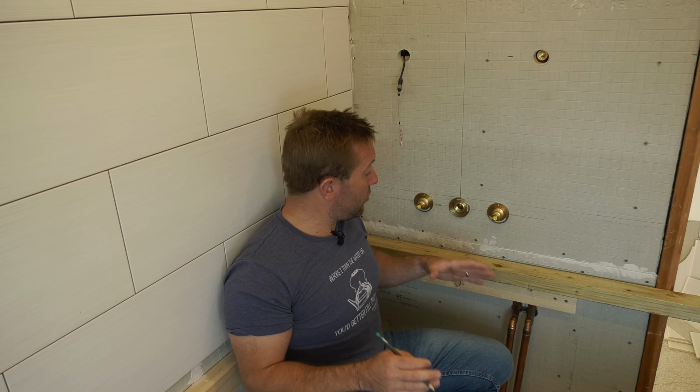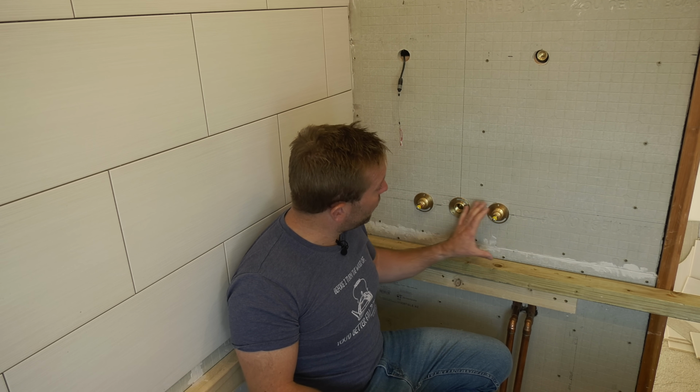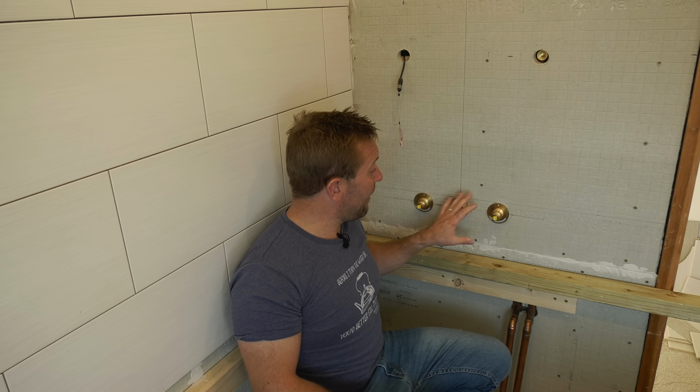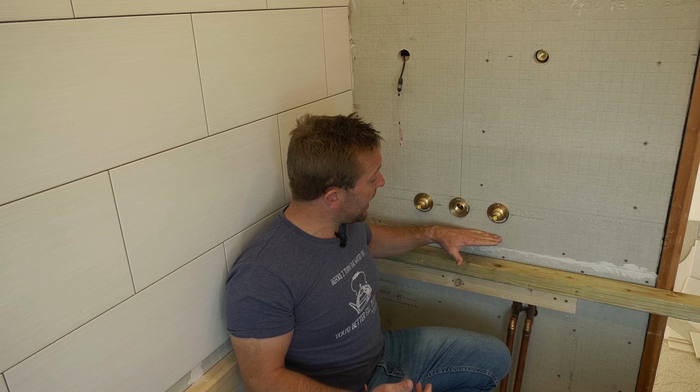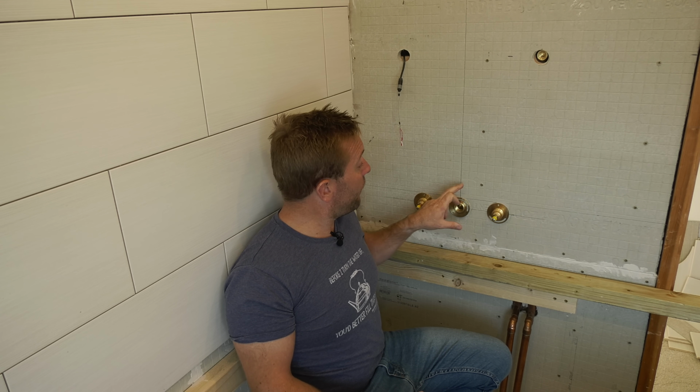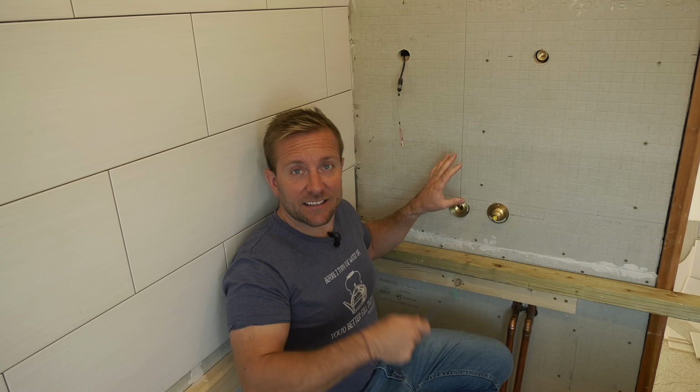But what we need to do, we need to think, where do we want our first row of tiles to be? Do I want my first row of tiles to be within all of this lot here, where we've got these outlets here and all that sort of stuff, where I've got to do cuts and all that sort of thing, and if we make any mistakes then it's going to throw the rest of the wall out when it comes to the whole 3D scheme of what we're going to be doing? Or do I want to say, right, I'm going to just do a quick set out without any adhesive so I can find the bottom point of the next whole row of tiles? Do I need to do that? Yes, I think I do.